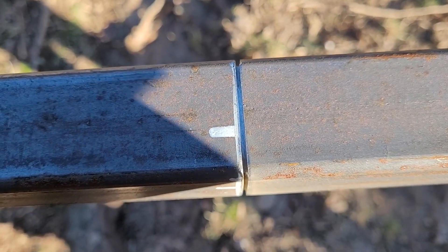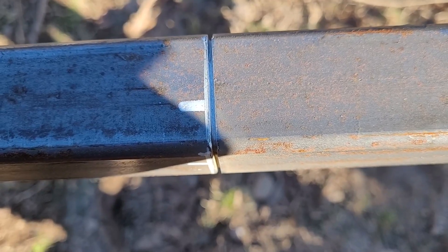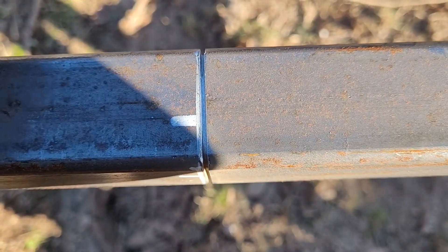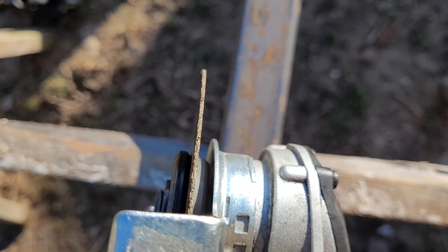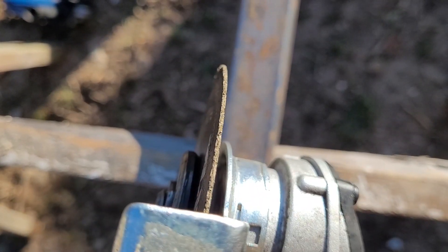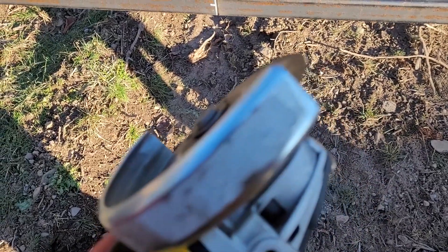What I've done is cut a shallow groove to give me a line of sight with the blade so I don't go crooked. I just followed the line without putting any pressure — I let the tool do the cutting. I'm using a thin cutting wheel. Ideally I'd use one of those horizontal bandsaws, which I've used before and really like, but this is all I have right now. You can use a battery-operated one — they work fine but the battery won't last as long. I'll be using a corded one.